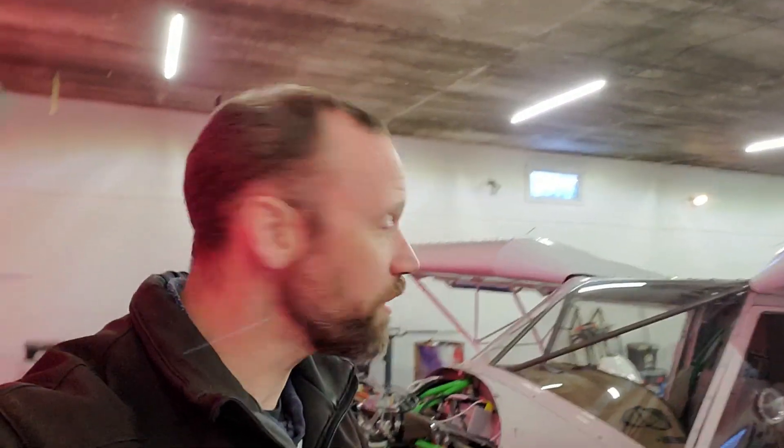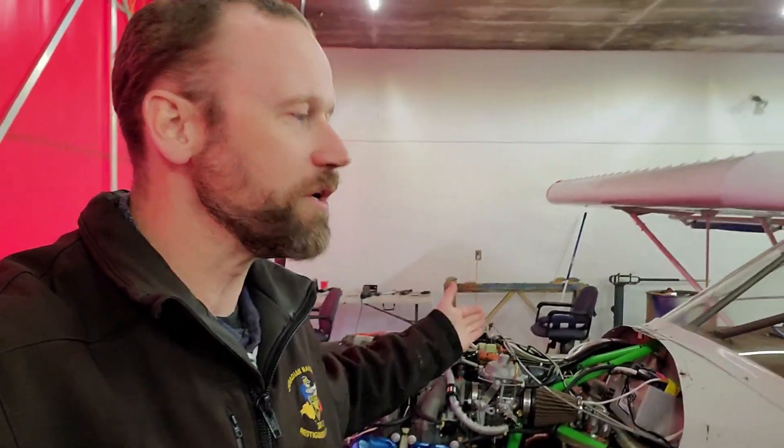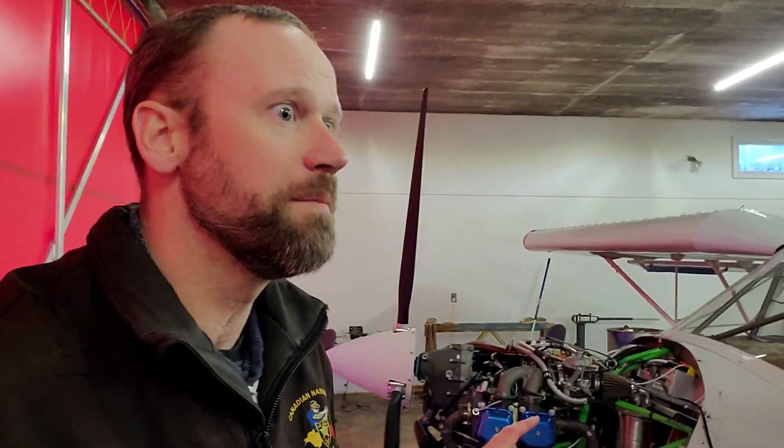So that's the plan — we're going to tear the airplane back apart, modify it, and make it even better. One of the cool things about having EFI is we won't have to tune the carburetors anymore. The carburetors won't exist, so it'll always be correct. We won't have to balance them or adjust them for different temperatures. There's no chance of carburetor icing anymore because there are no carburetors. It's going to increase our fuel economy significantly — by about 15 to 20%, which is a huge improvement in fuel burn. They say you also pick up a few extra horsepower. I'm really more concerned with the lack of maintenance — you just turn the key and it works.